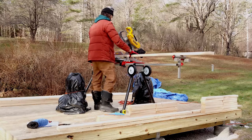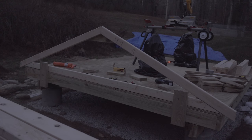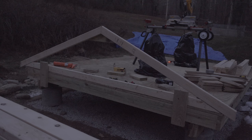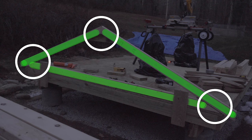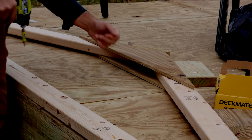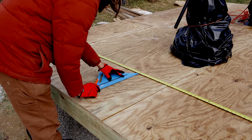The floor being done is great because it provides a nice level surface to build on that is the exact dimension of your finished structure. So before I put up the walls, I actually built all the supporting structure for what will be the roll-off roof. Typically with a roof, you have a ridge board at the peak that you connect the rafters to. But I'm going with a different design — building trusses where you don't use a ridge board. You instead cut the rafters and the bottom cords very exactly so they all join up perfectly, then connect the three boards with metal or wood gussets, basically a flat connecting piece at each corner. I'm doing trusses because they seemed easier as someone doing this on my own. YouTube videos I watched suggested the best time to make them was before you put the walls up, so you can use the shed floor as a place to set up a jig. So I followed that advice.